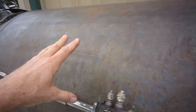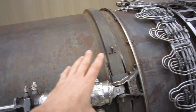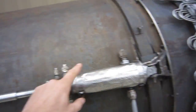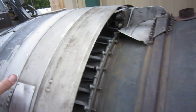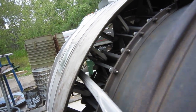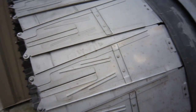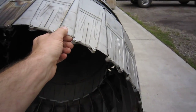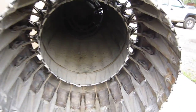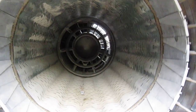This is part of the exhaust nozzle, and this whole section along here is the jet pipe — it's where the afterburner burns its fuel. There's not much in there. This is an actuating cylinder which controls the position of the exhaust nozzle. Cooling air always mixes through there. These petals are in the closed position for maximum thrust without the afterburner; when the afterburner is running, they open up considerably more.